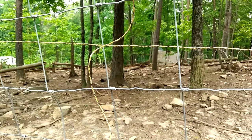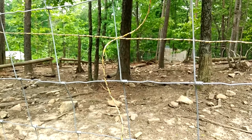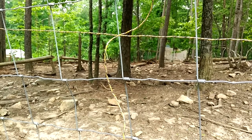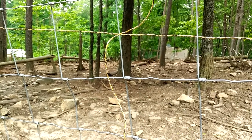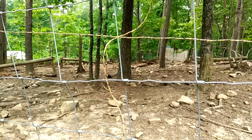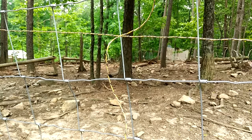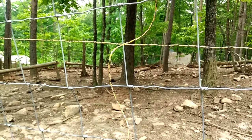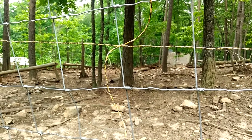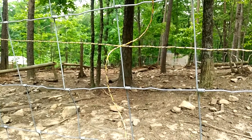I noticed my pigs were not responding to the fence very well. And I checked the wire, and it was hot. And I ran the voltage on it. I've got a voltage tester. And the voltage said 4,500 volts. And I said, wait a minute, it should be showing about 7,000 volts. There's a lot of volts in an electric fence. There's no amperage. The amperage is measured in milliamps. Otherwise, it'd kill you. Volts gives you a shock. Amps kills you.